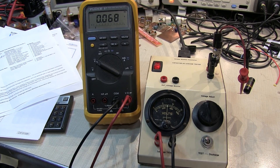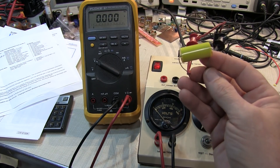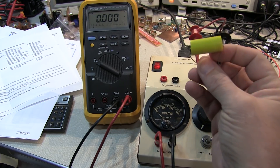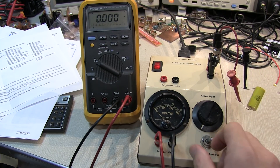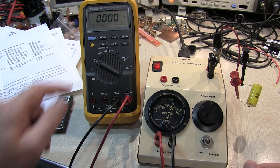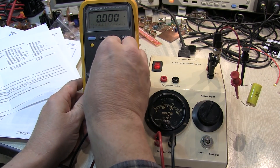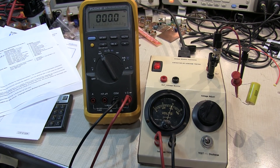Just to give you an idea of a replacement capacitor for those paper caps or Bumblebee caps, here's a film capacitor that is effectively brand new. Let's test this guy up to 400 volts. Bringing it up to 400 volts, we're not reading any current at all. Even switching over to the millivolt scale, we're not reading anything - and that's really ideally what you want. These non-polarized capacitors are going to leak minimally if at all, which is what you want to see on non-polarized film caps.